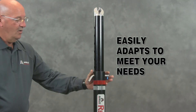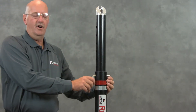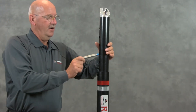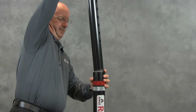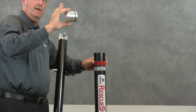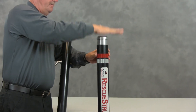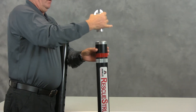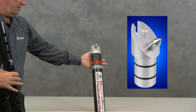What if your inside tube is too tall and you'd like a shorter strut for the job? Release and move your spring pin, remove the extension tube, then locate and insert the tube adapter into the end of the outer tube, and insert the standard universal head that comes with each strut package.